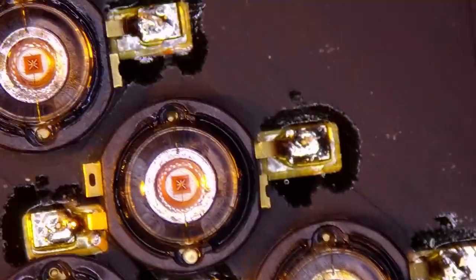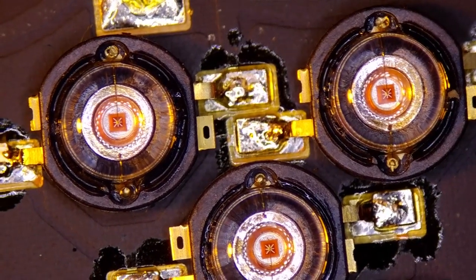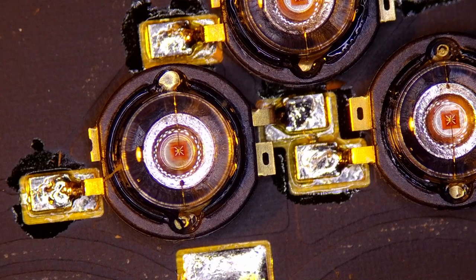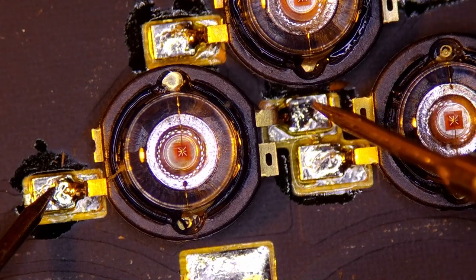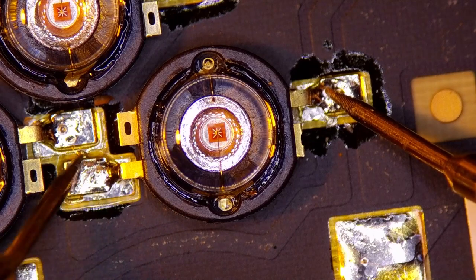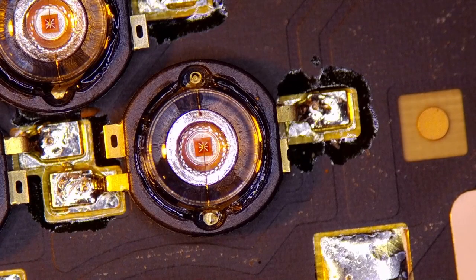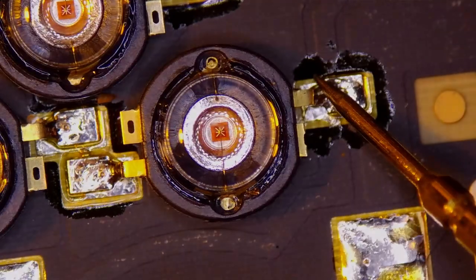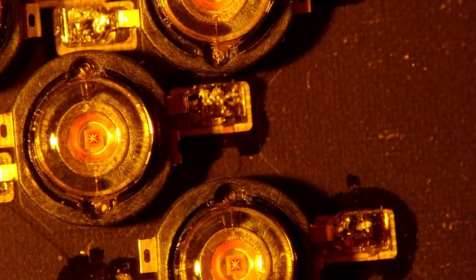Let's go over to the microscope. This one looks a little bit better — I don't see any visual problems on the board. These LEDs look nice and crisp. This is coming from the yellow light. So let's do our original test and see if these light up. I'm not hopeful. Test lead here, test lead here — nothing. Test lead here, here — nothing. Let's reverse. Nothing. Nothing. Nothing. It's possible it's just too bright and I just can't see it.